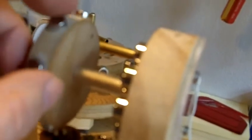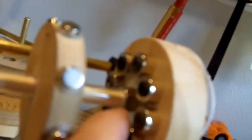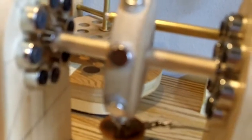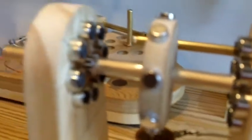This armature in the center here is a wooden block. It's got eight little magnets glued to it. The outer support blocks have each got eight magnets screwed to it with quarter-inch deck screws, evenly spaced on each end. On each end of the shaft there are two magnets on the shaft — two there and two on the other side. The magnets are being repelled very strongly by the eight magnets surrounding them.